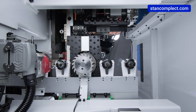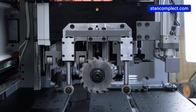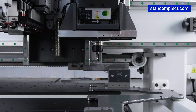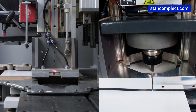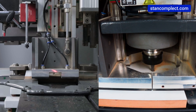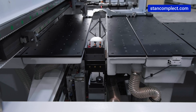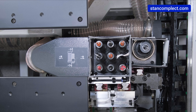The tool changer has five positions. The grooving unit has a disc with a diameter of 120 millimeters. The upper milling spindle is equipped with a vertical clamp with two plates, which increases milling accuracy and prevents damage to the workpiece. The lower group has nine vertical drills and a 3.5 kilowatt, 18,000 RPM milling unit.